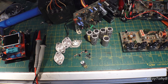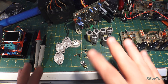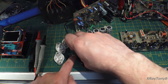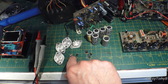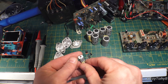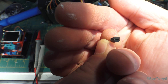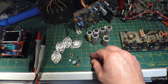In front of you are so far, not all, but most of the bad components that I have already found to be really bad. The Triac is shorted. This burned-up resistor is completely charred off of one of the channels. This one was in series with it — it's scorched but still reads continuity. This transistor is shorted, this transistor is beyond shorted — it's actually cracked in half. These diodes are dead shorted.